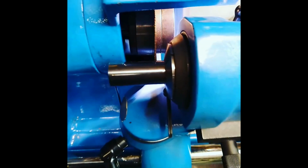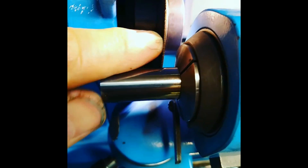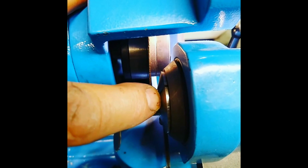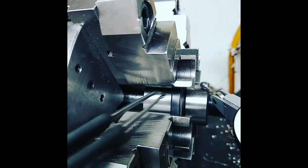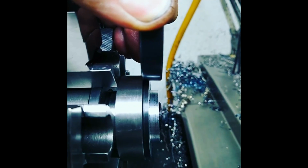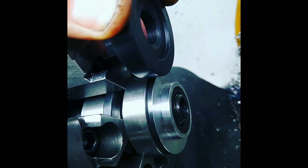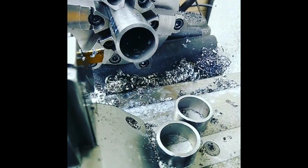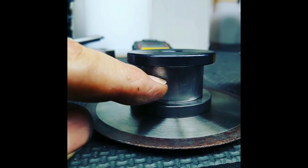I do a lot of cutting off with these very thin diamond and or CBN discs, but this extra thickness back there on the nut and that spacer keep you from cutting off things as close as you'd like to the collet. So I'm going to modify that. This is my collet mounted backstop. This is the actual arbor off the grinder, and I've indicated it in. So from the other piece turns into what you see in the lower piece there. Plunge a bevel on the nut with my adjustable tool. Part off 2 spacer rings. Spacer, original spacer, wheel, and our modified nut. Now you can see I can get really close to the collet nose and cut things off much better.